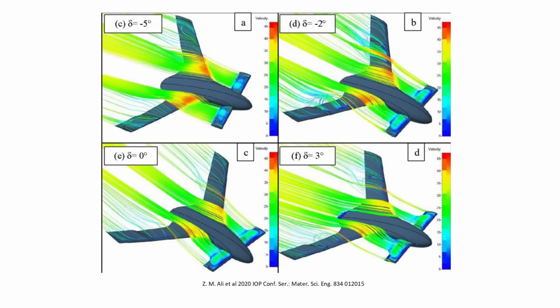Like I've mentioned, the aerodynamic interactions between the wing and the canard are super complex. The lift-induced tip vortex coming off the canard can interact with the main wing in a way that generates a flow too complex to evaluate with just simple calculations. And this really requires CFD or tunnel testing. So for now, we're going to neglect those effects and try to get in the ballpark of a representative system.